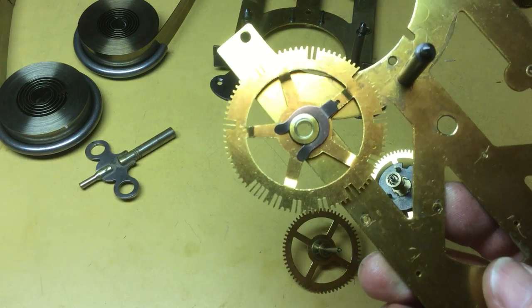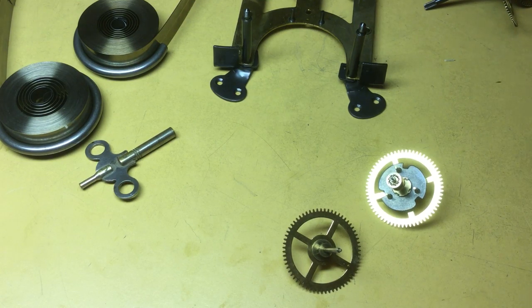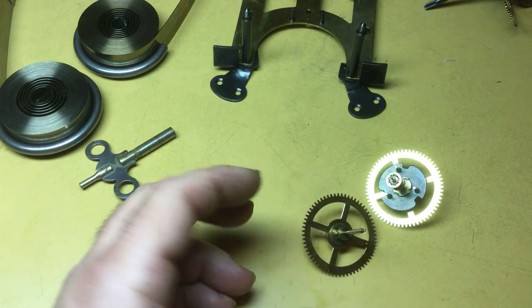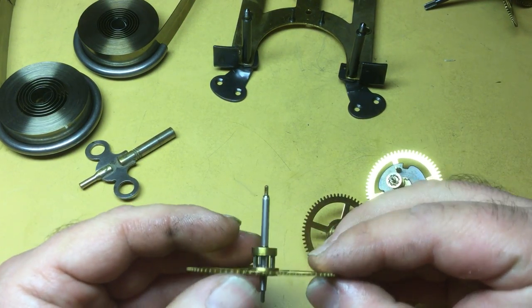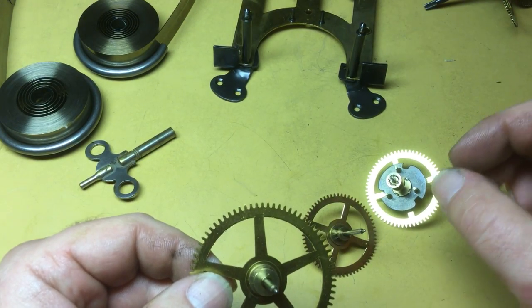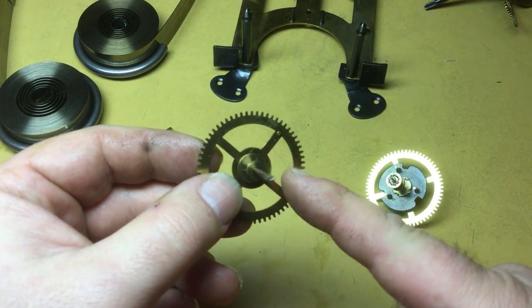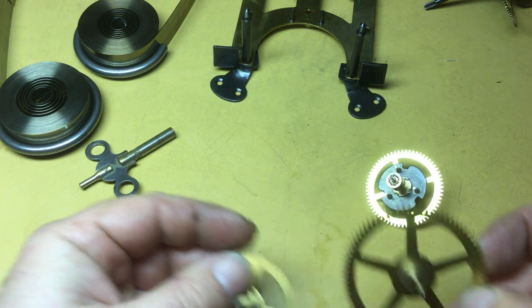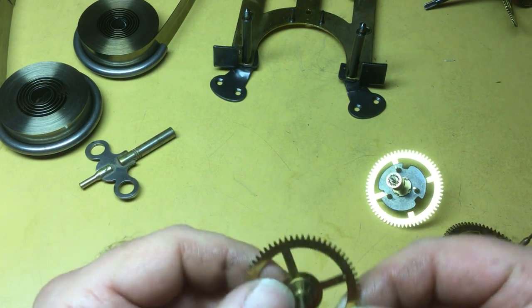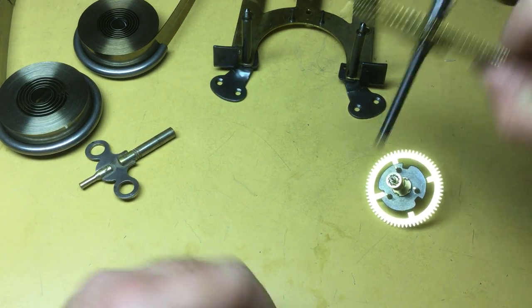The count wheel is just the standard American-style clock count wheel. All the parts are so conventional that I could mix them in a pile of US clocks from the 1910s time period and you wouldn't be able to tell which parts are which. It's neat how they copied the crossing arrangement of the Ansonia clocks — the larger wheels have five spokes and the smaller wheels up in the train have only four. Anyway, see you for the next part, where we'll be making some repairs to the main wheels, the great wheels. This is Oklahoma Bridges — thank you for watching.